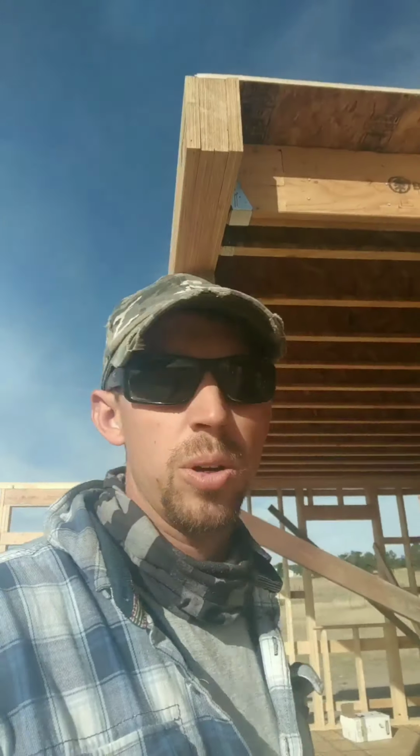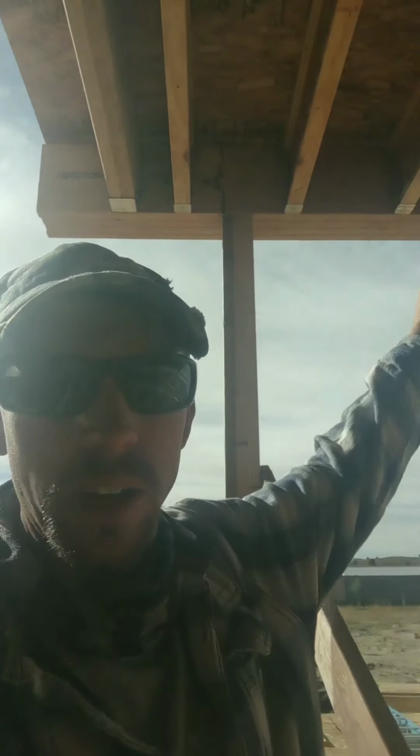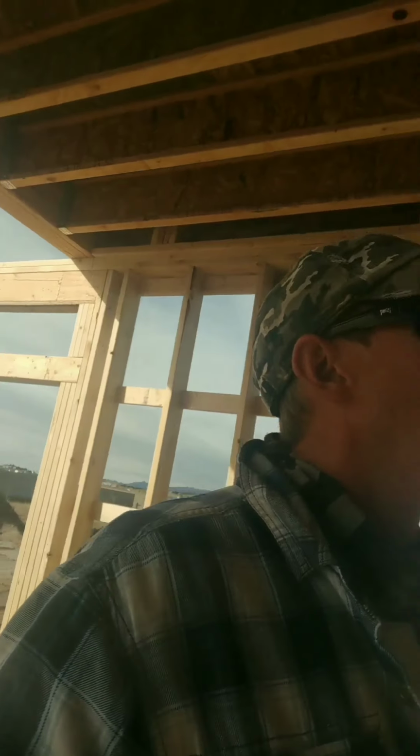So we got those up, and these joists sit flush with this beam, so they require these hangers, which I can show you. They are designed for this specific joist. Each joist has different kinds, but they have some flanges on top and require like 8 nails, 6 nails. So that's kind of what we did, and then we put the subfloor on, and we also did some roll blocking up in here,